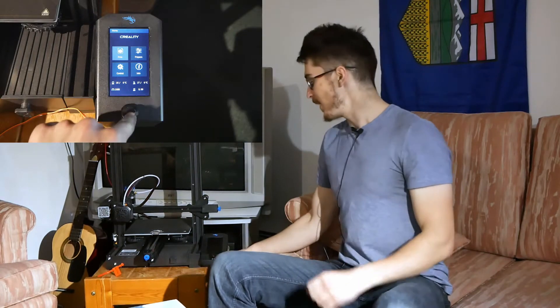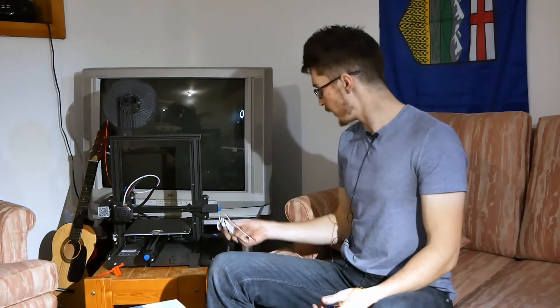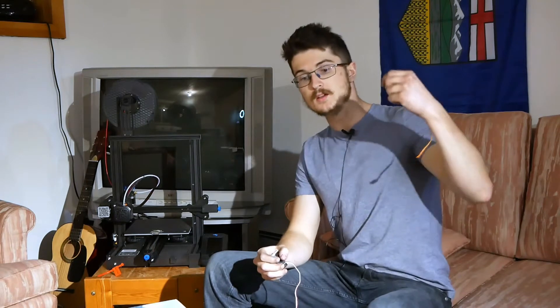As you can see, this display is controlled with this knob at the bottom. You turn it right to select things on the right and left to select things on the left. My solution is to use a smaller servo to rotate the knob left and right using some good old two-way tape, and a second servo will be attached somewhere on the display and will be able to pull the first servo into the knob, thereby selecting something.